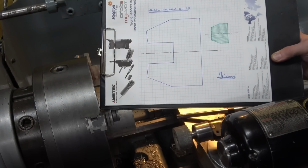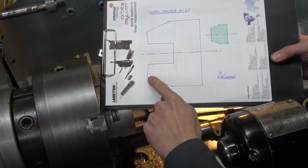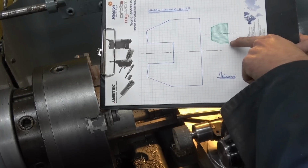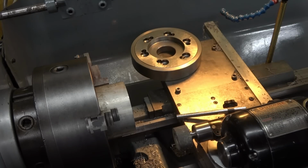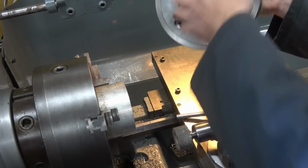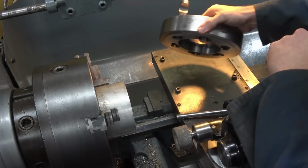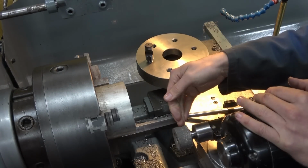Now when that is spinning, much like a milling cutter, the back relief here will run all the way to the extremity and it will describe a flat face as shown in green. So my spinning wheel will actually look like this. That is going to allow me to grind the angled portion in the centre, in there, and it will also allow me to grind the flat face. Now the argument is, why align the spindle when you're going to dress it?